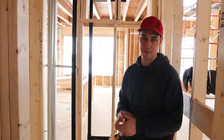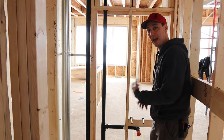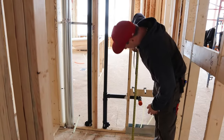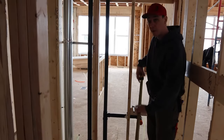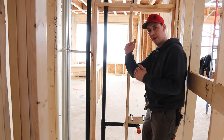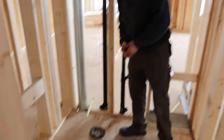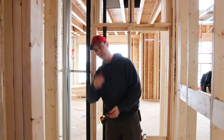Actually, we forgot about the half bath here. This is important because it's a pedestal sink — there's no cabinet, you can't be coming up through the floor. So we came up through the wall here and stubbed them out. We're about 25 inches to the water lines and I like about 20 to 21 inches off the floor for a pedestal sink, so the drain is high enough that you're not using an extension on the chrome trap at finish. The water lines are kind of hidden behind the pedestal itself. And then again it's just another toilet water line — we're going about 6 to 8 inches to the left, about 3 or 4 inches off the rough wall.